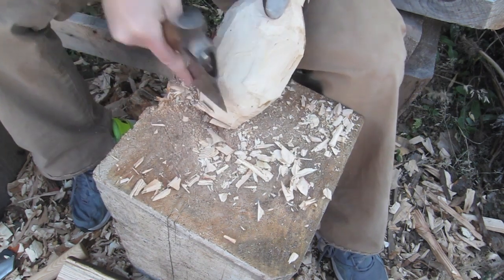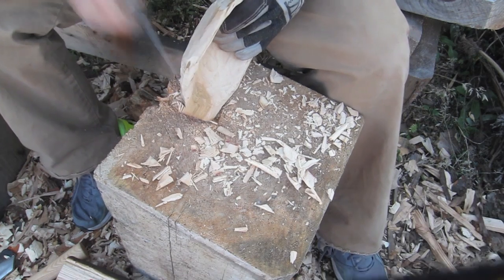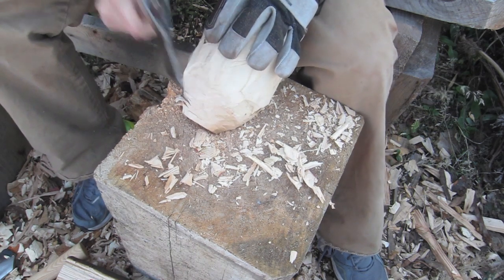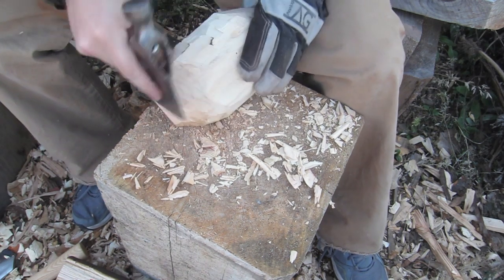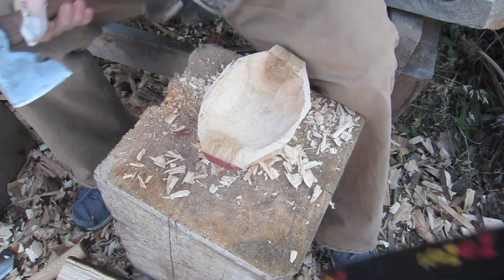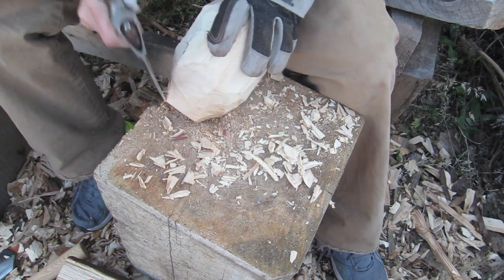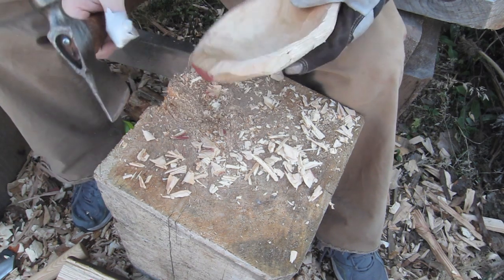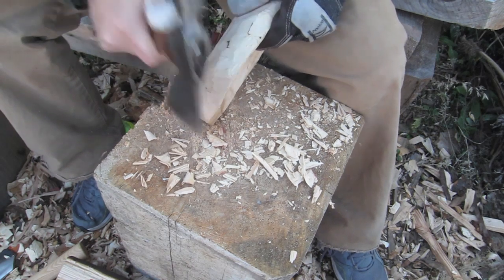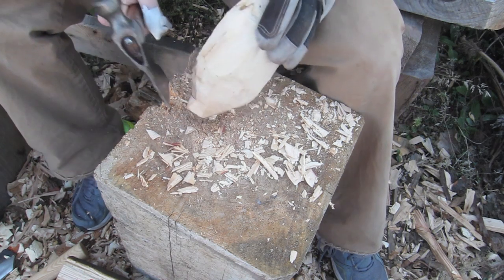I've carved over a hundred spoons and I do some pre-carving on my regular wood carvings like figurative stuff and wood spirits. I'm just slowly taking in the sides, taking my time, pretty choked up on the handle. I did cut my thumb a bit on another project — you can see it's pretty bandaged up. One of the reasons is so it won't get dirty, because an open cut will smear blood on your carvings and the blood gets deep and is hard to get off. I didn't have any band-aids so I have a big old silly paper towel wrapped up on there.